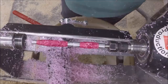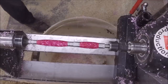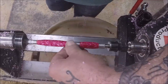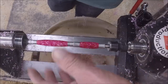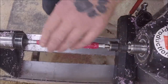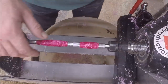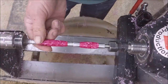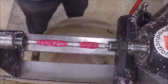Close enough — hot pink crushed lava. Now we get to sand. We're gonna go probably 120, 220, 320. I had some vibration in here and I'm not sure if I messed up my mandrel or not, but it's vibrating in the center even though it shouldn't be. So I've got some chatter in here I want to get rid of. We can sand most of it out. I've got a little bit of lip, I think it's that vibration — I'm clean on one side and I've got a lip on the other.